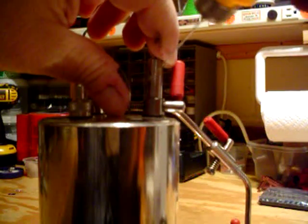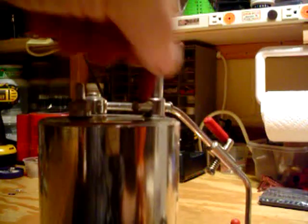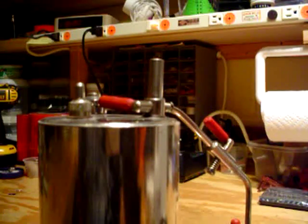You use exactly the same technique on the whistle up here. Push it back from the rear, squirt a little oil in here and a little oil here, tighten it up, and move it around like that. Most of the time that'll keep water or steam from leaking out of those valves.